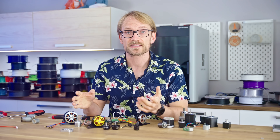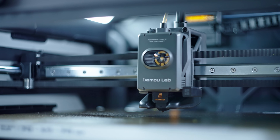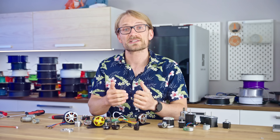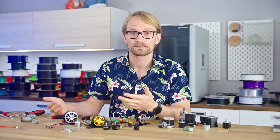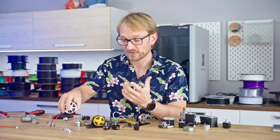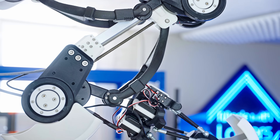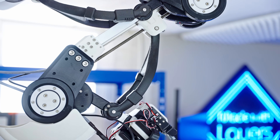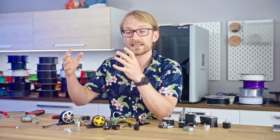Under normal circumstances, the CoreXY motors on a 3D printer will only need to move the toolhead, which ends up being a pretty well-defined and very predictable use case, so needing to compensate for things outside of your control isn't something that these motors typically need to do. A robot arm, though, where you're interfacing with real things — physical objects in the real world — that is definitely not exactly predictable, and there a closed-loop servo is very much needed.